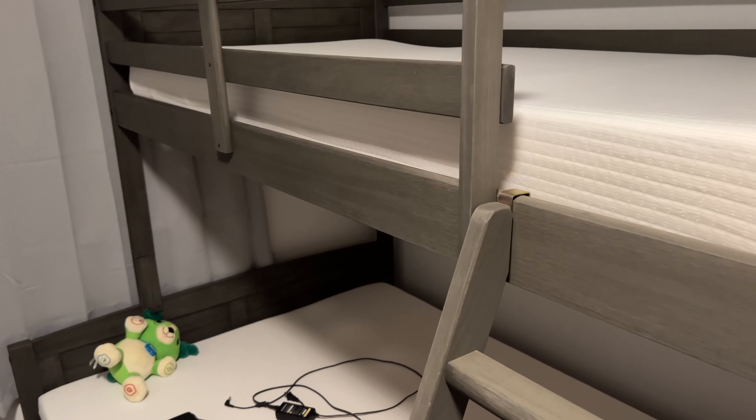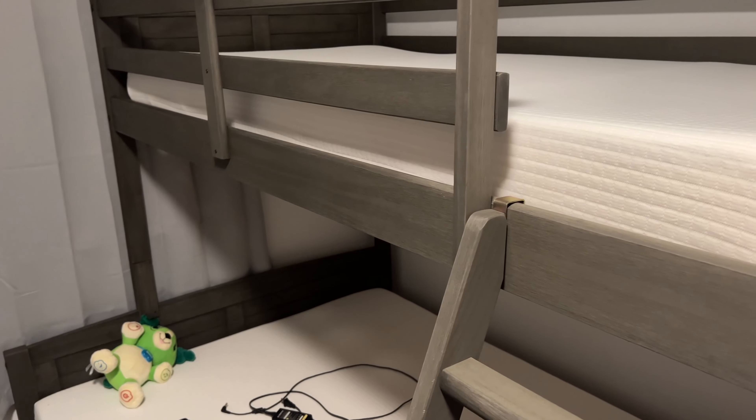When you're building this, they want you to build the bottom bunk first and install the slat boards, then separately build the top bunk with the slats, side rails, and braces. Then they want you to carry the top bunk and set it onto those little dowel pins on the back posts. That little section from the bottom bunk to the bottom leg of the top bunk is actually free-floating, so you have to line that up with the bottom of the hole before you screw it into the bottom bunk.